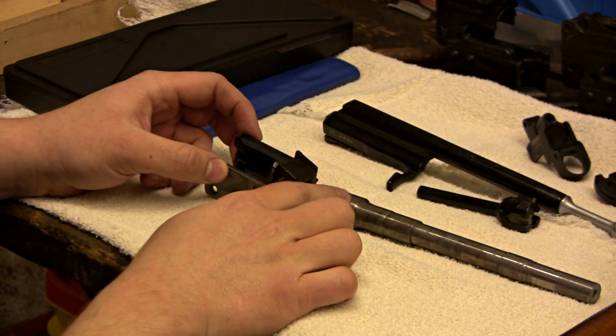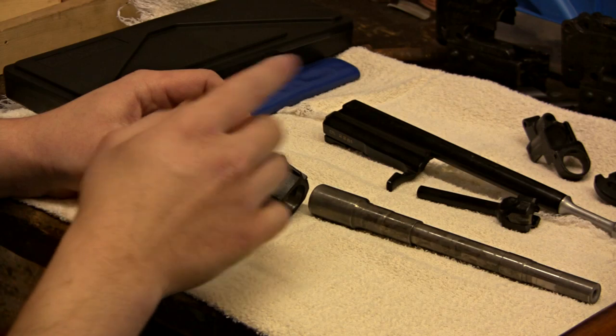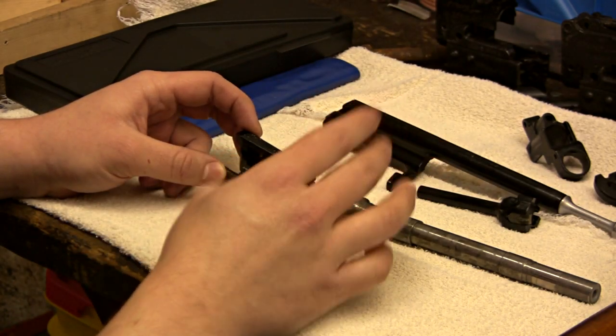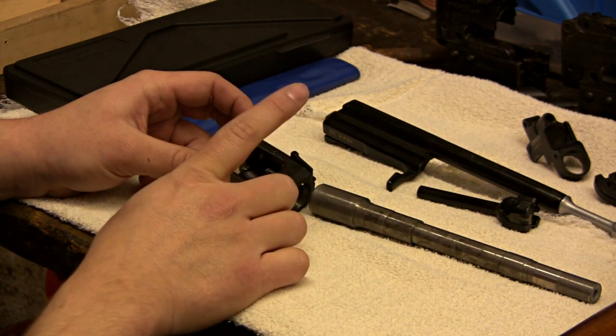The new US barrels have to fit a range of parts. Your trunnion might be a little bit bigger than another trunnion that they have to fit this barrel to, and vice versa. This barrel might be oversized a little bit so that you can turn it down to where it will fit nicely with your trunnion.